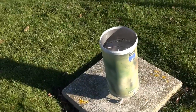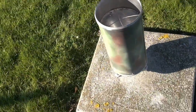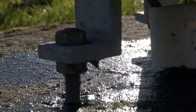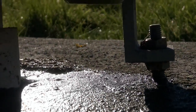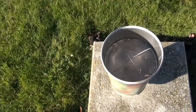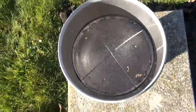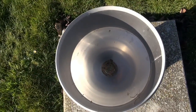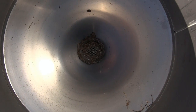The first thing we want to do is just do a quick visual. Is the rain gauge looking okay? Check the foundation — the bolts going into the concrete, the stainless nuts, their condition, nothing deteriorated, the concrete's not cracked, the general legs, where the cable's going in — no problem. And also inside, what's it like when we first arrive? You can see in this case there's bird droppings, there's a little bit of dirt under the top screen. If we take the screen out, you can see below there's also grass right down on the bottom filter before it goes through to the buckets.